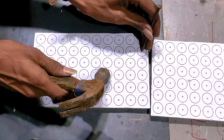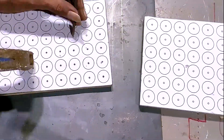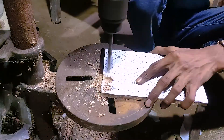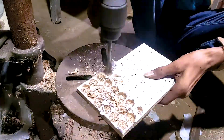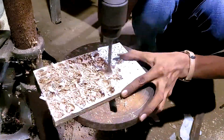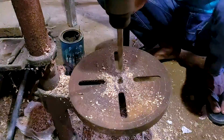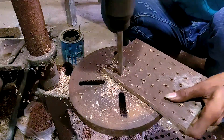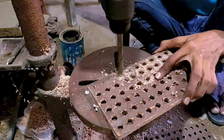You can mark the pilot holes with a big nail so that drilling is easier later on. Then use an 18 mm drill bit to drill the holes, but you should not drill all the way through — leave 2 or 3 mm at the bottom so it can grip the cells when we create a pack. Also drill the piece all the way through with a 12 mm drill bit so we can solder the cell terminals in the next video.